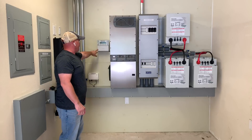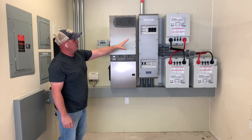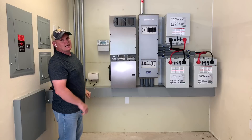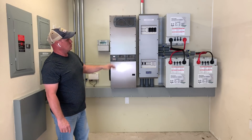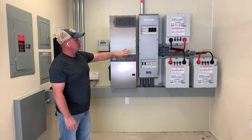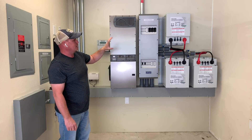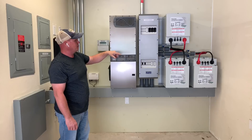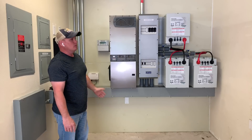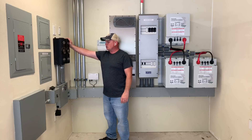In here we have the Mate 3 controller for all the Outback hardware. That connects to the ComBox, which takes all of the data coming from the Discover batteries and inputs it into the XanBus, then expedites that to the Connect Insight portal. I'm going to run these for a couple of weeks in an open loop platform — where the batteries have no communication with each other — just to see how they're operating and always learn more. The next step when we come back will be to hook up all the AE bus and get full monitoring capability on the web.